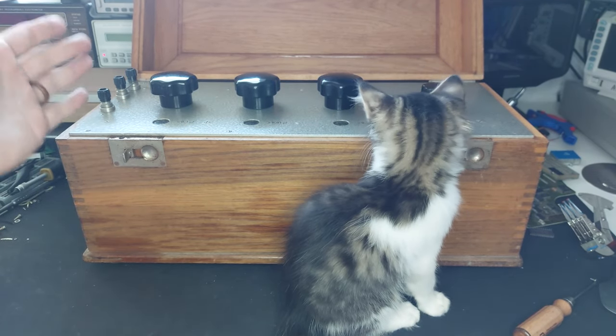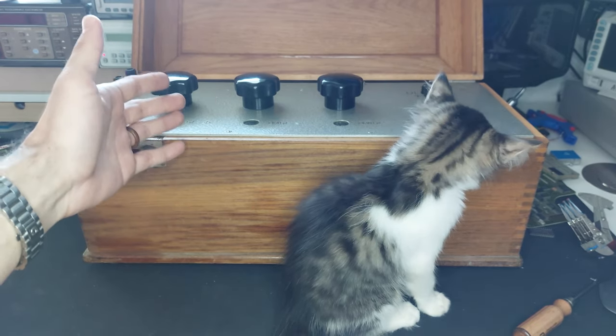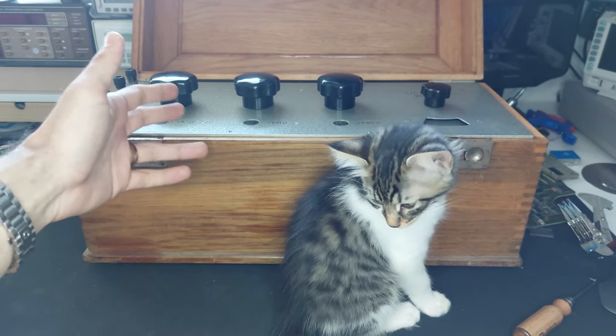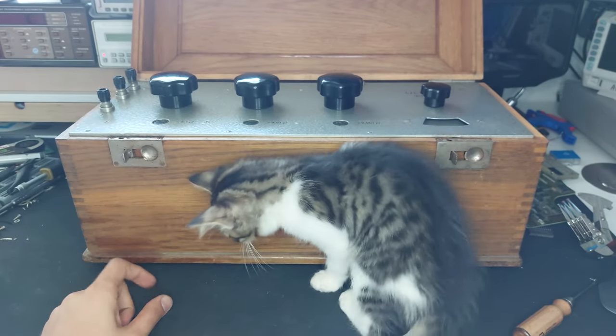Or, for example, you can calibrate the electrometer in its charge function. So in order to calibrate the charge, it needs to inject a current through a capacitance and measure the rise in voltage, and that's how it deduces the charge.